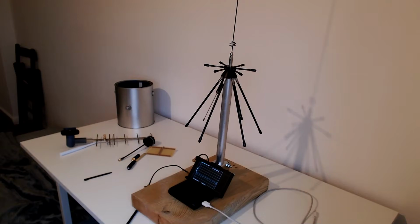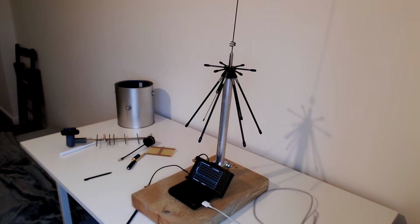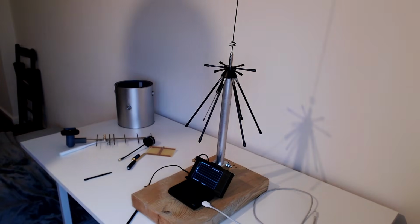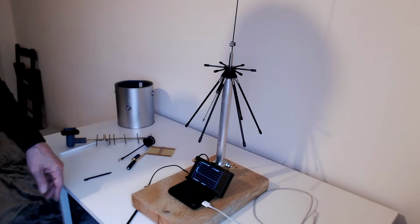Another thing I noticed is that I can read the height of the line from the other side of the room. You can tell this is getting serious because I had to turn the light on. And what I'm doing is walking around, and you can probably see that as I move near the antennas, the line goes up and down because of reflections from my body, multiple reflections and cancellations. So this is going to be a very rough measurement.